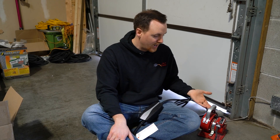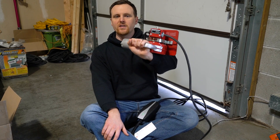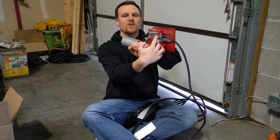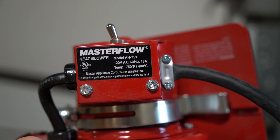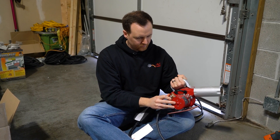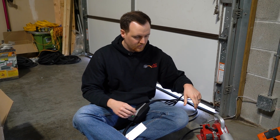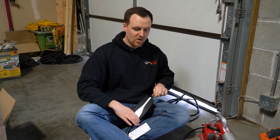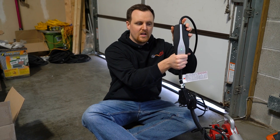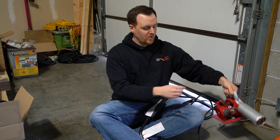For this example, we have something that's exactly 18 amps — this heater here, 18 amps, 120 volts — so we can actually run that. That's going now, and the Tesla is still charging, and no breaker has been tripped or anything yet. I'll turn this off so I can keep talking.